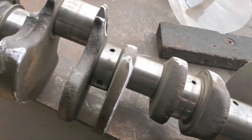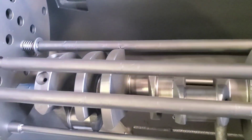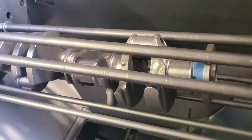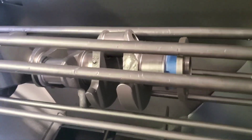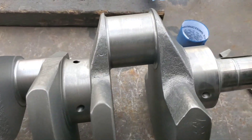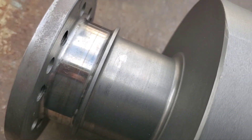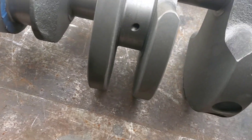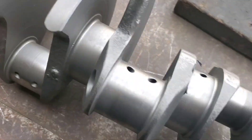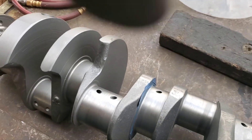You don't need to be swinging that extra weight, so we've got it off there. Don't forget to like and subscribe. Okay guys, we've got Rick's crank all shot peened, and you can see we've turned it the other direction — it's a game changer. We smoothed it up. You can see that casting flash is gone, all slicked up. You can see the seal surface is polished just like it was when it came to me. The snout's the same way. We don't shot peen those like some shops do — don't want to induce any abnormal wear or damage into the shaft. You can see I've got the thrust all taped up — let's get that off and I'll be back.